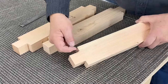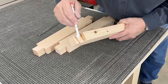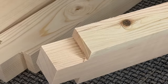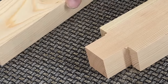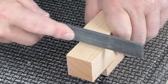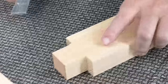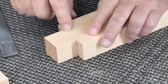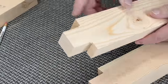After we got done cutting our notches, we had this little point here that didn't clear out. Let me show you from the back side — you can see where the saw blade cut, there's our kerf cut. When we cut across and took out our little piece of wood, we're left with this little tiny notch. What we want is a nice crisp corner like that. I've just been taking my file and filing out that little point so that it's a nice crisp edge, flipping it over and doing the same thing from the other side to clean out that little corner.